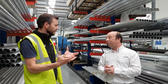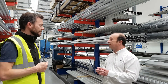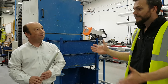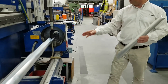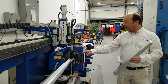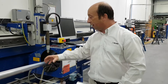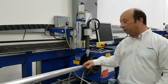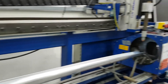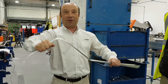The first thing we have to do is start the tapering process, and we do that with this machine — a CNC controlled plasma cutter. We've taken our mill state piece of aluminium tube, laid it into the machine, and this cutting head cuts out the V. As you can see, this is the piece of material that was cut out of this section. The tube rotates, the cutting head moves backwards and forwards, and that cuts this parabolic piece of section out of the middle of the tube. In mill state the material is very soft and flexible and really has very little strength to it.